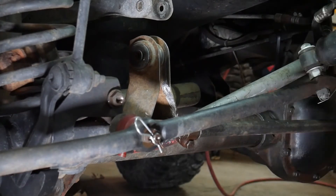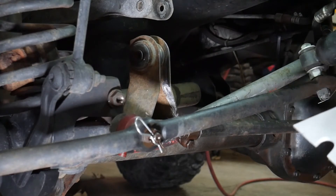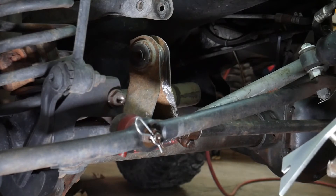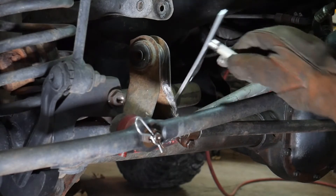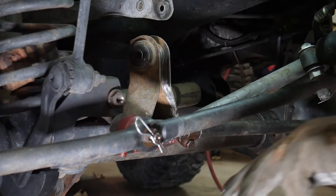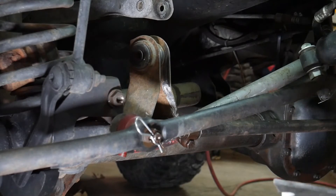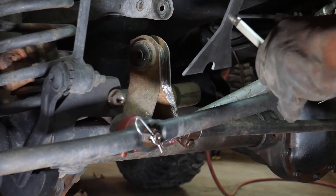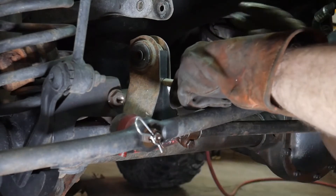With this cleaned up, what we've done is taken both our parts and looked at the back side of each part. We went in and sprayed it with some weld-through primer so that the paint will hopefully survive most of the welding process. You want to be careful you don't get too much on these outside edges because if you have a lot of that primer on these outside edges, you could have a problem with getting good welds in there. Then we basically just got a magnet on a stick here and we'll use that to help us place this in position and hold it there while we get our tacks made.